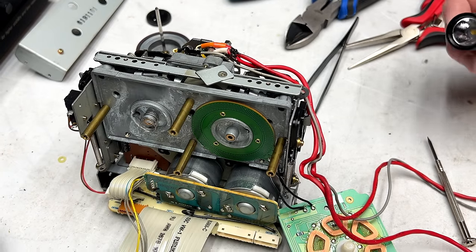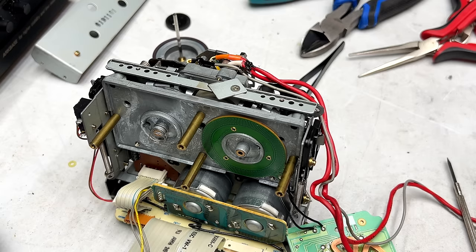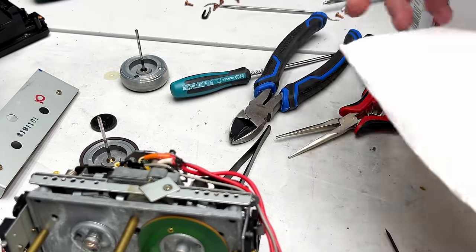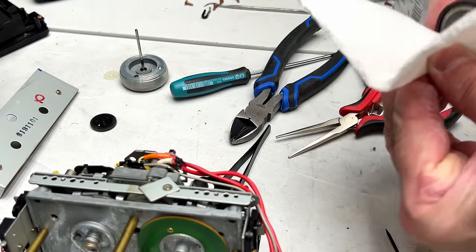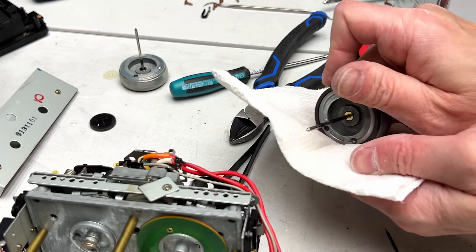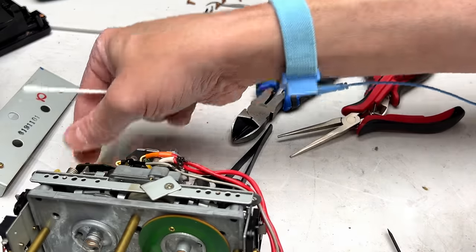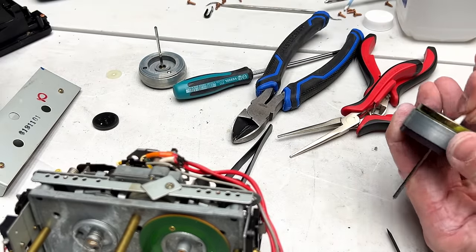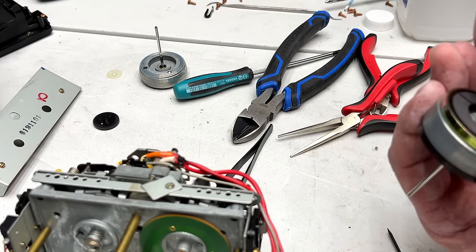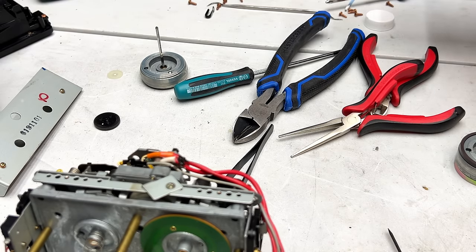Okay, that's two. Now you can't see what I'm doing, but I'm going to use my flashlight and look from behind and see if all the fibers are out. It's time to clean some flywheels and such. Get my hands full of acetone while I'm at it. There does not seem to be an excess amount of debris on this flywheel. Yep, got a screw stuck to that. It's not good. You gotta watch it around this magnetic stuff, because component leads will stick to this and you won't see them, and they create problems that way. Almost had that problem happen with the 666ES.